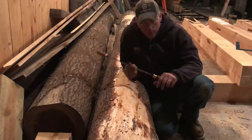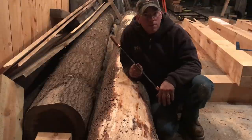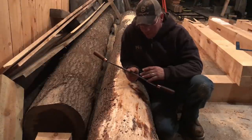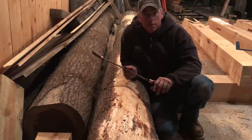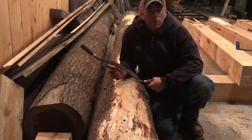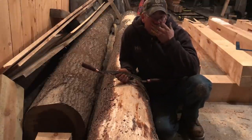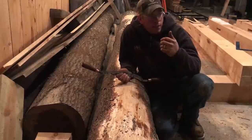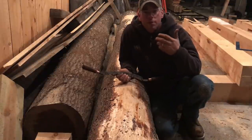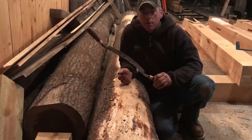But he only did a 400 degree temper on it, and I bet you he had to be up closer around 500 or 600 degrees for it to really temper. Every steel is a little different. So when you watch a video and they say, yeah, I'm working on this mystery steel that I'm not really sure what it is, and they go to heat treat it, you can't really heat treat a steel properly unless you know what it is.